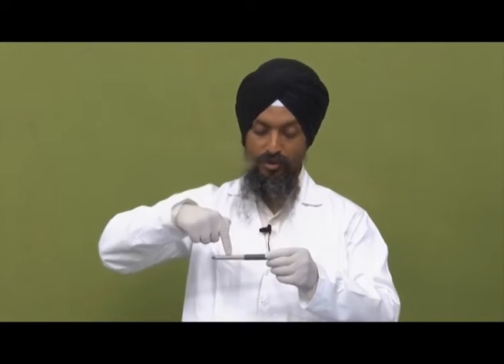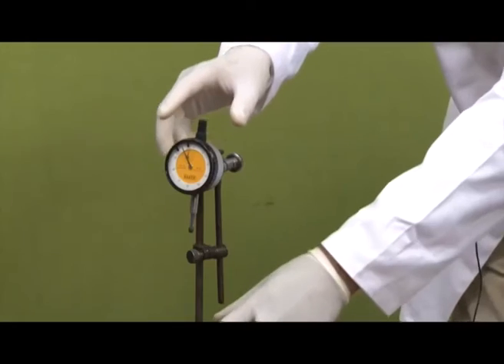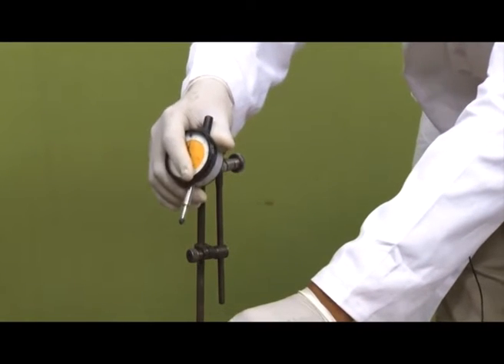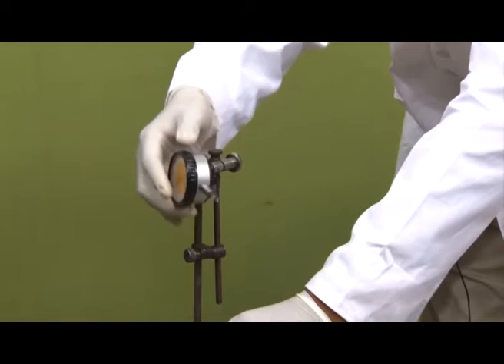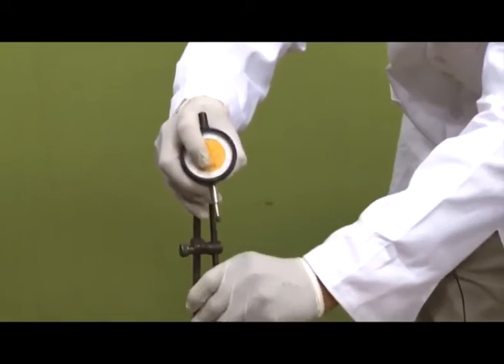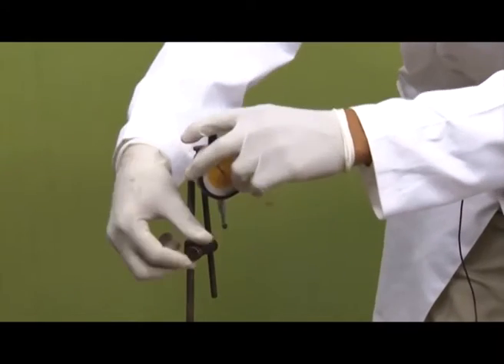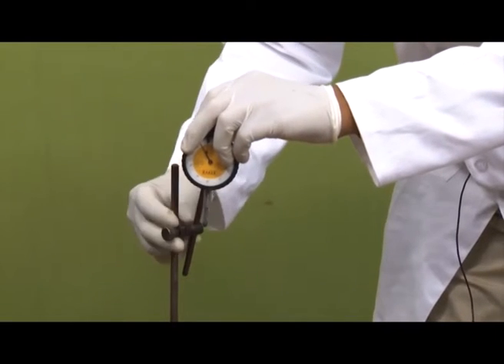What is the application of the dial gauge? In case of rotating shafts, the dial gauge is placed on the rotating shaft to see whether there is an offset, play, or eccentricity. We take the mid value of the readings. The dial gauge is attached to a stand — a dial gauge holder — which has a universal connection allowing movement in any direction with 6 degrees of freedom, and the height can also be adjusted. So it can be fixed wherever required.